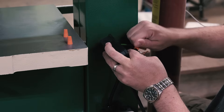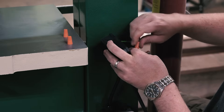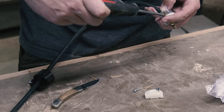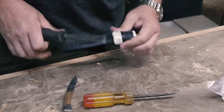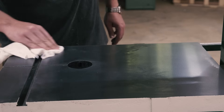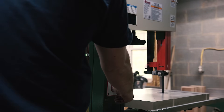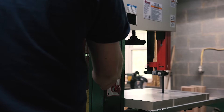While that was drying, I added the power cord. I visited two electrical supply houses looking for what the manual calls S-type cord, only to find it at the home improvement store under 14-3 service cable, sold by the foot. After wiring a new 220-volt receptacle, I plugged it in and made sure it was getting power.